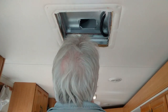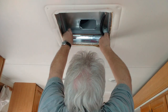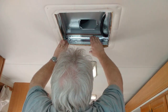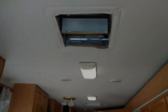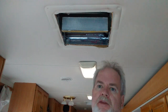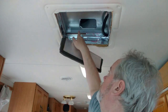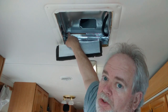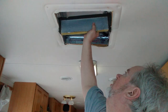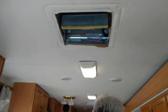My nephew-in-law is the one that told me to get tape that has the red print on it. It says 'premium foil' and it's much heavier duty than your standard foil tape, because you only want to have to do this once. Make sure you get it all sealed down in behind because if you don't, air gets up underneath there, it blows dust and eventually it doesn't seal well. The long screws here hold it up there and they'll pull down. There are some little tabs on all four corners, and what's supposed to happen when you compress that gasket enough is that will come all the way down — that tells you when you've tightened it enough without over-tightening or under-tightening.